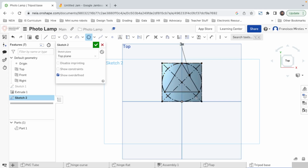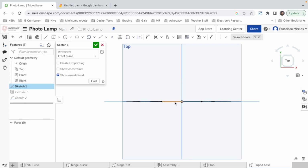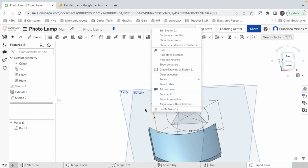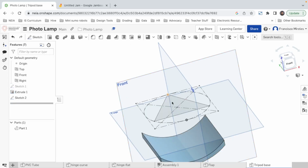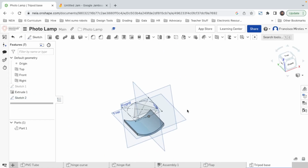I think it's too small. All right. So I'm gonna go back to the first sketch. I'm gonna edit it. I'm gonna say instead of 25, let's do 8. So that would be 40 on the middle. And then the extrusion, let's see how the sketch changed. As you can see, the sketch changed only on one side, but if we change the extrusion to 80 as well, then the triangle should grow bigger. Okay, good. So we can do that. Actually, we can create a variable that changes those at the same time, but for now, let's just know we can change it by modifying those 2 parameters.